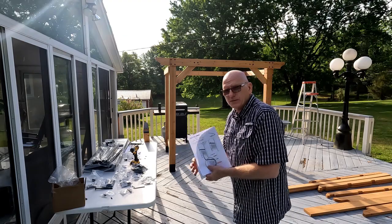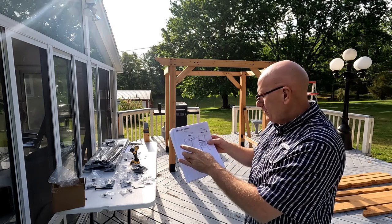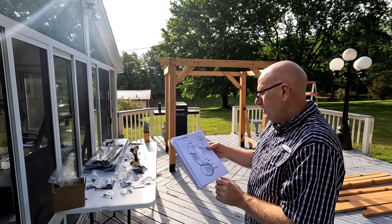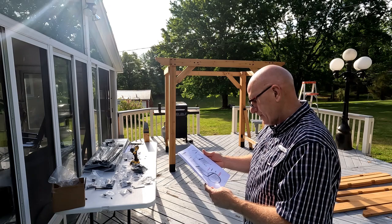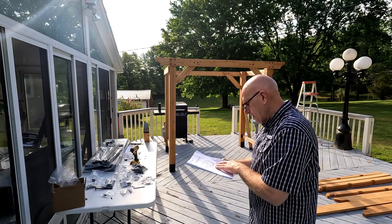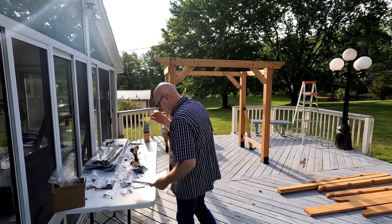Stick in the metal tubes. They're on page 21. Drop in all the metal tubes at the bottom. Drop the thing I just built across the top, then later it's going to tell me what screw to use to hold it in. Put the spindles in, set your top rail on it, get your 1.5-inch leg bolts, 8 of them.